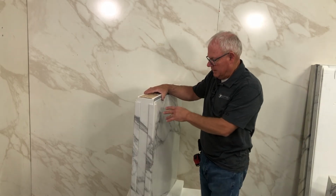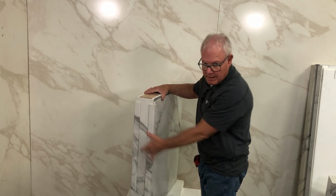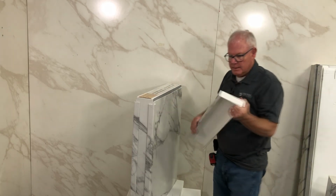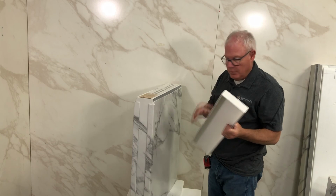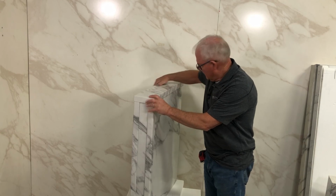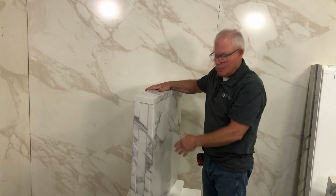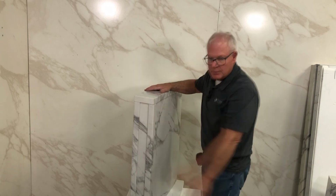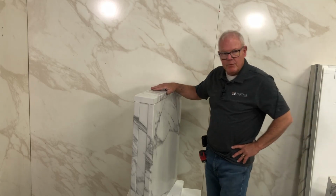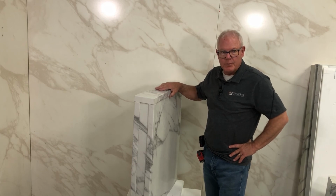Another popular method is very simple: 3 panels, the sides and the face, 3 individual panels, and then this very same cap that we'll build here, or if you want to try it, you can build it. This will go on, and then you put your 1.5 by 1.5 inch outside corners around here to hide those seams, and that's easy. That's probably the fastest way, but everyone has their own style, and of those 4, you just take your pick which works best for your project.